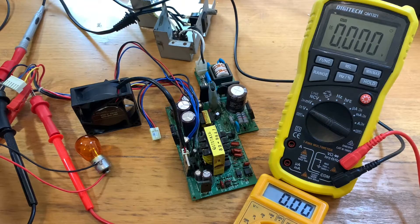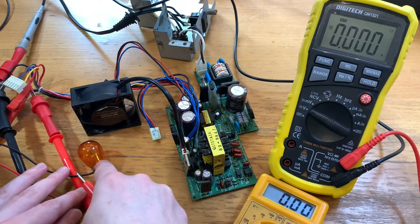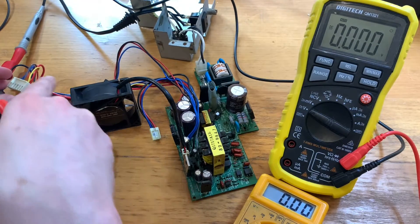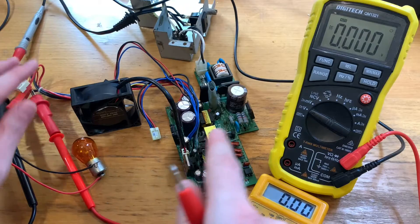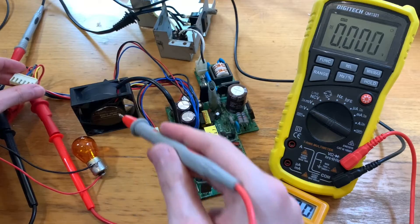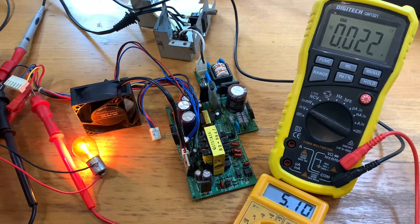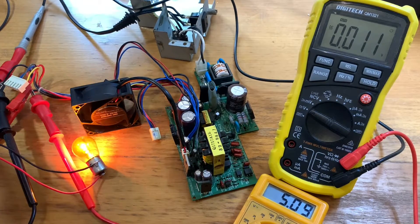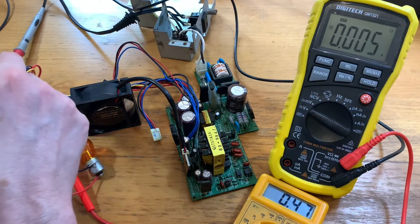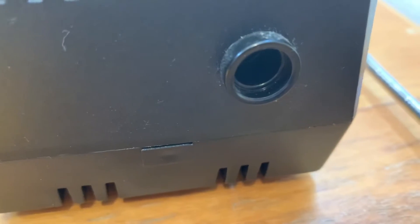So like last time we've got the multimeter on the 5-volt rail and another on the second 5-volt rail, one on the 12-volt rail, and one floating free so I can measure all the other voltages. Hopefully it works. Look at that — it freaking works! Let's check the voltages. No — it's just gone. It totally blew the fuse in the step-down inverter.